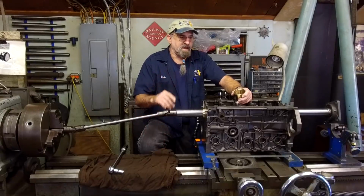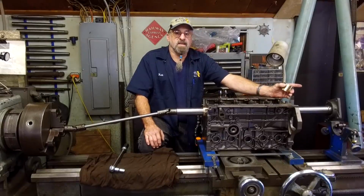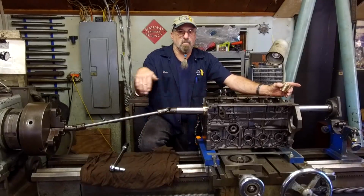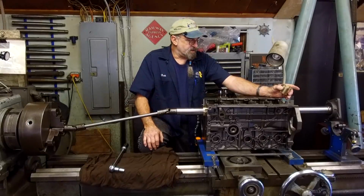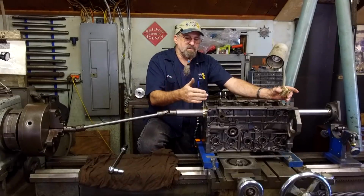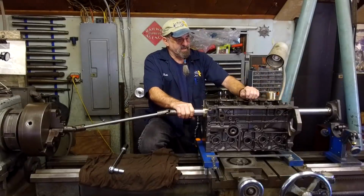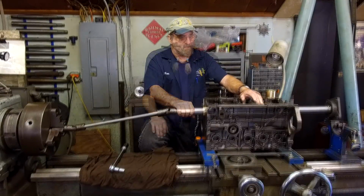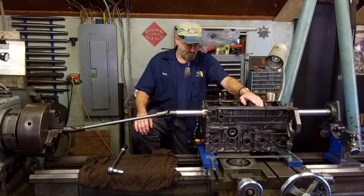The reason why we're going to do that is so that when we're traveling back and forth, that thrust bearing is not forcing any off travel in any direction. So we're going to double check just to make sure that we're parallel with the height and parallel with the side to side run on the bar itself. Other than that, we don't have to dial the bar in. We're using the original alignment to run our job, and then we'll see what we can do for some camera shots on this operation. So let's go ahead and head on into the plasma cam now and cut that plate out.